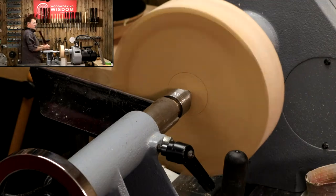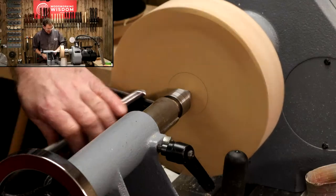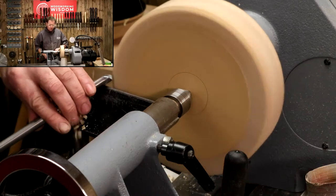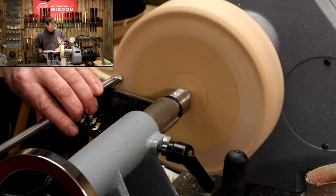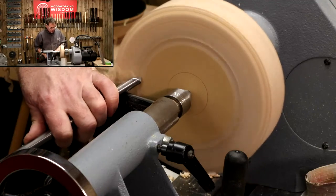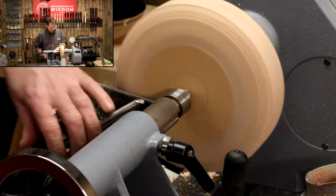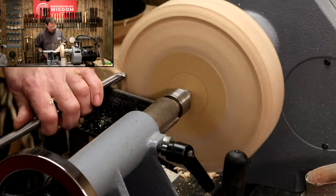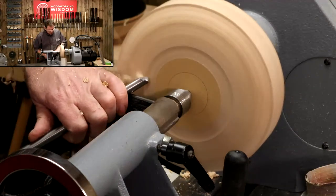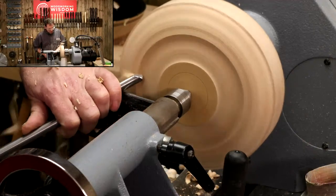What should we have? Select a weapon. 3/8 bowl gouge. All right, so we're going to do a drag cut. Hand over the top, check things are tight. We're going to start our outside shape, just literally pulling round to me. The flute on this is actually fighting me. Right over at 9 o'clock, I'm tapping with that left hand wing. We're not resting the bevel for this. Feet wise, right foot is forward, left foot back. So I can move forward on my body weight, back and forwards across this, just to pull that cut out. Now this is just thick bulk removal.